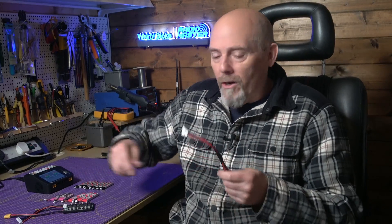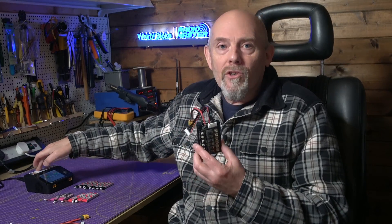I've been doing this for years but it has one really annoying problem. If you want to charge four cells in series you need one of these wires, and if you want to charge six cells in series you'll need to make up another one. But recently I started charging using this fantastic series charge board that allows you to use your balance charger to series charge anywhere between one and six 1S cells.